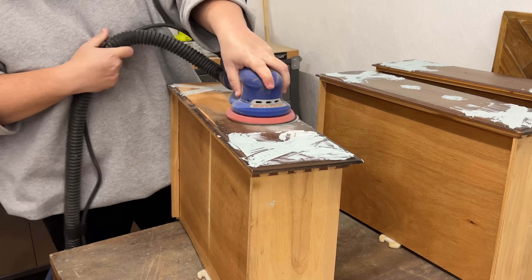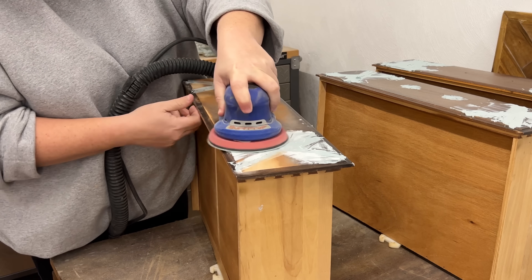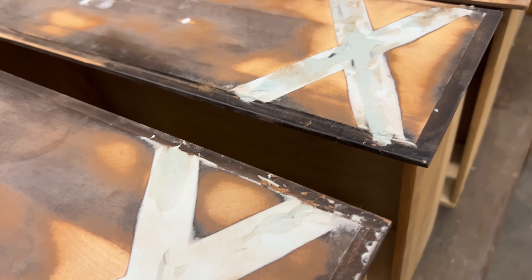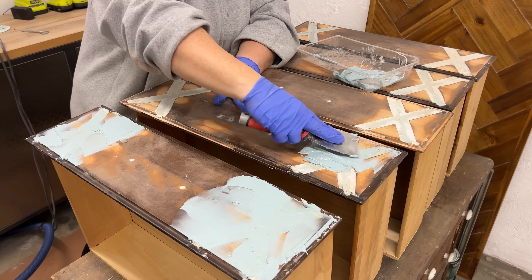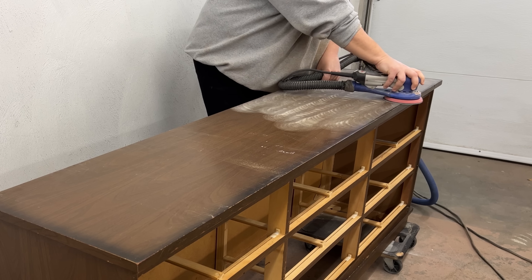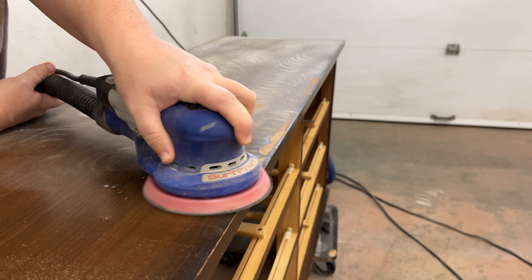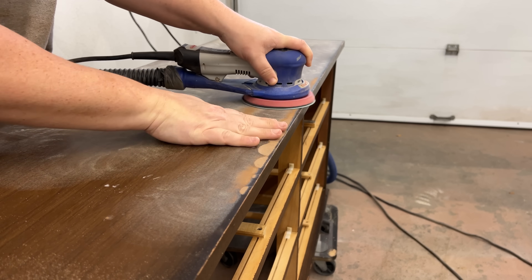Once that first batch of filler was hard I used a box cutter to trim off any globs that had gone over the edge and get the cleanest corner I could, then I sanded all of the big peaks down with some 80 grit and did another quick skim coat over the top to get in any remaining pockets. Then I sanded that smooth too, and because I was planning on doing such a textured finish on top I didn't need it to be completely perfect but I got it smooth enough. While I had the sander going I used it to smooth out any minor scratches on the dresser top, get rid of that bubbled up spot on the front edge, and also scuff up the rest of this really slick non-porous surface to create some micro scratches or tooth for my primer and paint to grab onto.